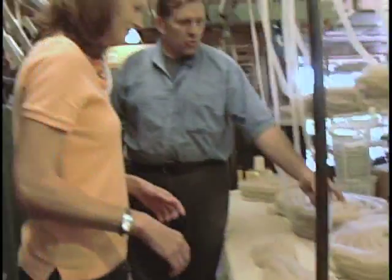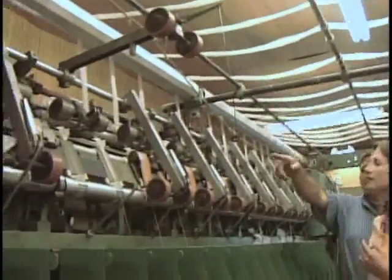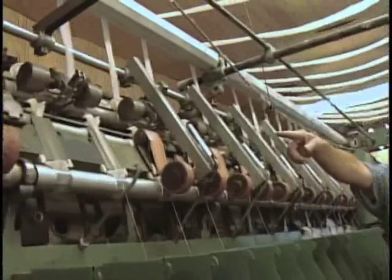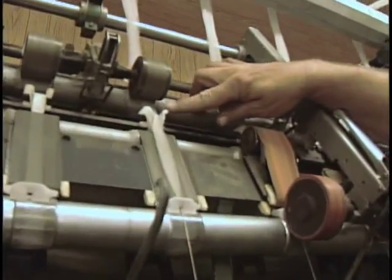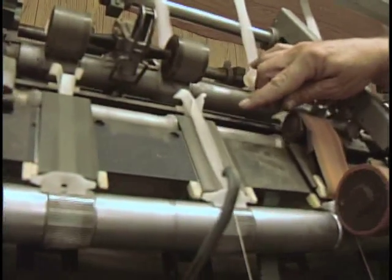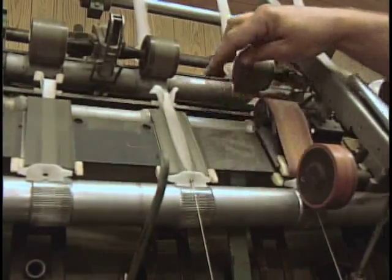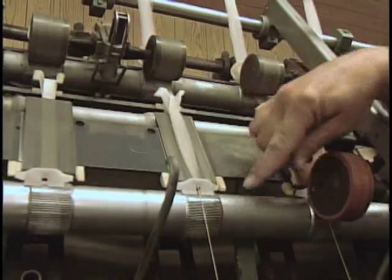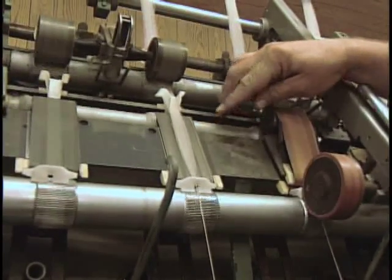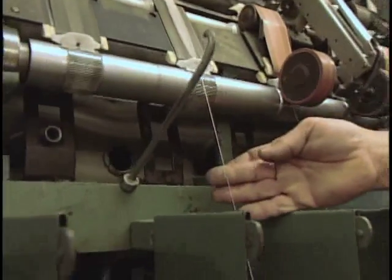It's going to come out of the coils just as it comes off of the pin drafter. Okay. It's going to go up over the top of our heads. Right. And it's going to come down into the spinner right over in this area. You can see where the fibers are going to get pulled down through. And when we did that weight, we actually determined what gears we were going to use to set the ratio between the speed of this shaft and this top shaft to determine the right size that's going to come out as finished yarn. And this creates your single ply of yarn.